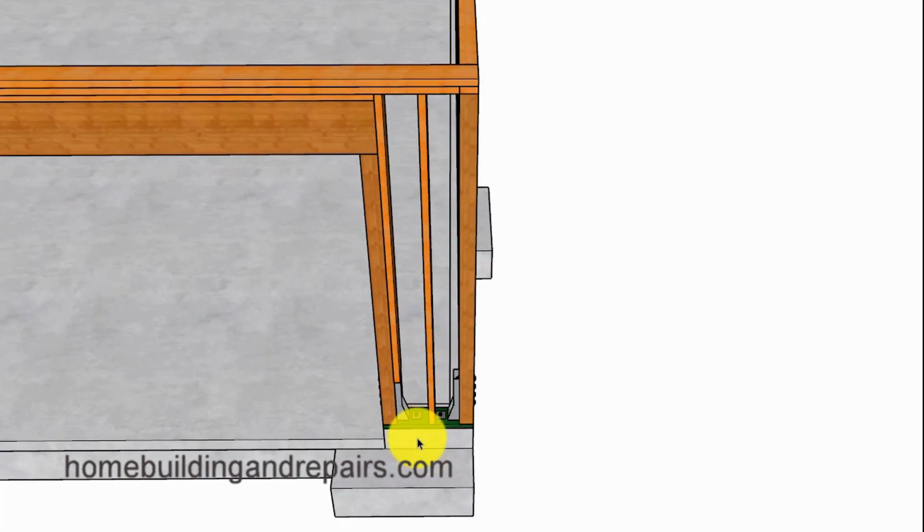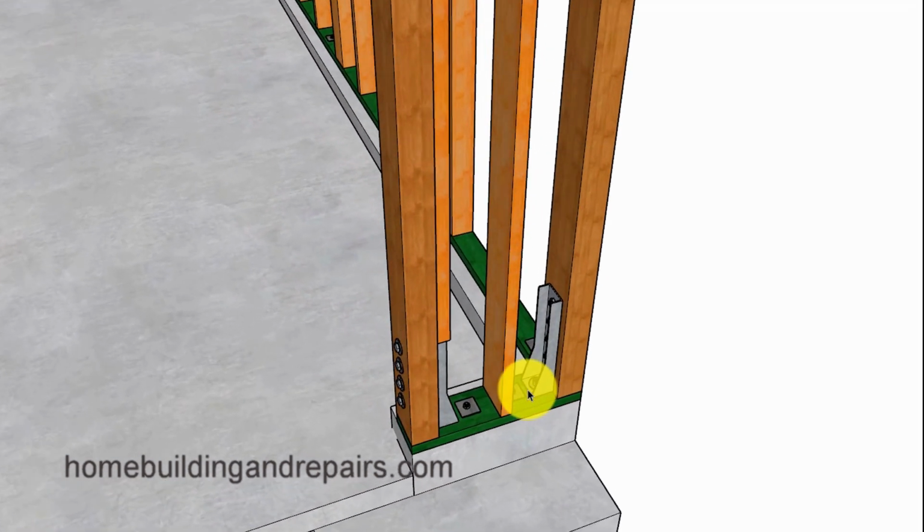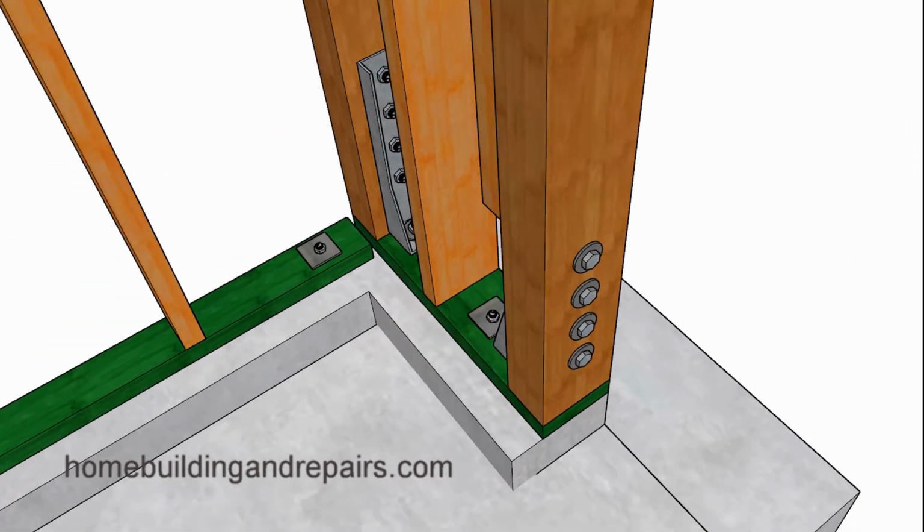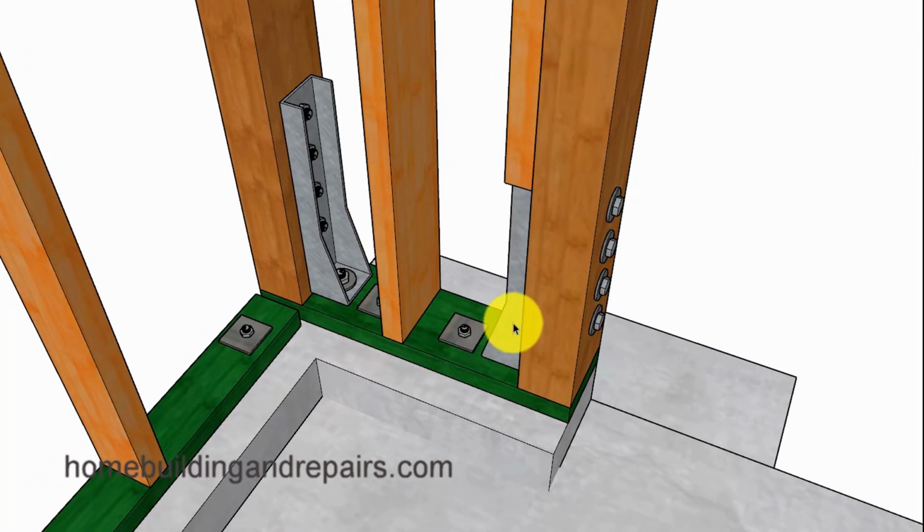And in this video, I went ahead and widened the wall here to make it a 2x6 wall so that I could install some 4x6 on each side here, along with some large hold downs. And for my newer viewers, I am not a structural engineer, and that means that you might need to check with a structural engineer to validate any of the information in this video.